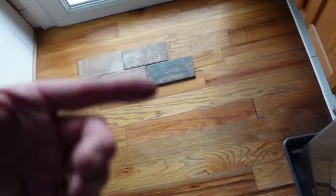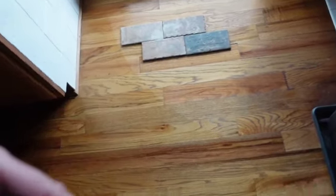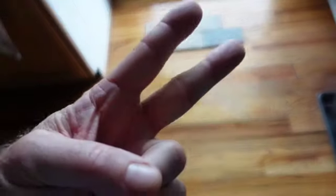That's okay with me, because as all of us who do wood floors know, at the beginning and end of the wood floor run, you can't use that angle nailer anymore. You have to face nail. So when the sun comes in here sometime in the daytime, it just cracks and pops and makes all kind of terrible noises. So this is going to do 2 things.